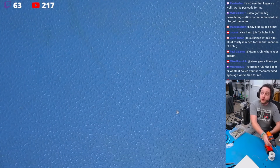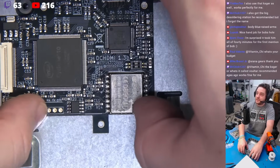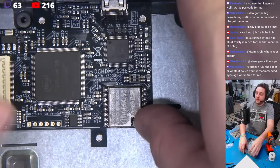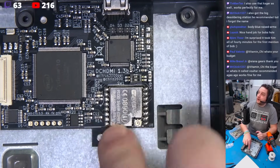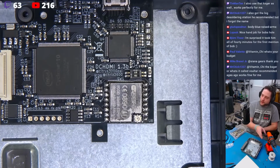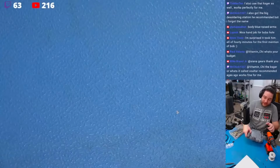First of all, before you do any drilling, make sure that your kit is very tight in position, and make sure that it is nice and level and plumb, which we are here. Now, you could use a little hole punch here, make some marks, and then pull the kit out and drill. I'm not going to do that. I'm going to use the kit as a drilling guide, as the guide says.